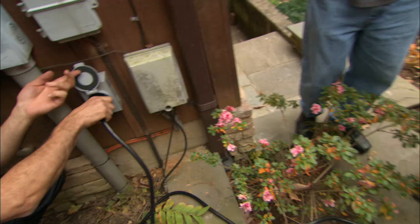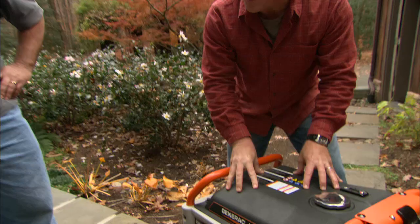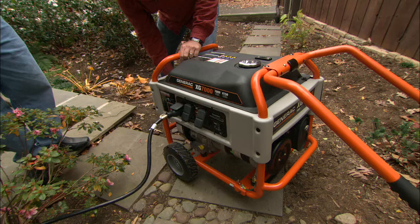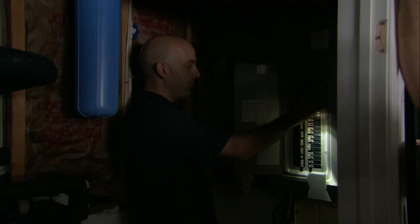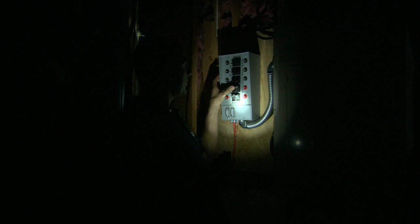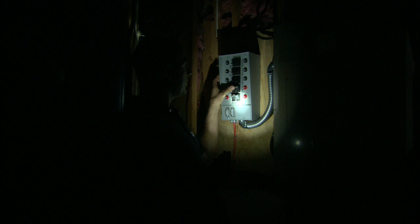This is working off of gasoline, so it is going to exhaust carbon monoxide. The generator stays outside and away from the house. Now that we have the generator running outside, we can simulate a power outage by shutting off the main. We'll go ahead and turn the switches from line to generator — and you are running on generator power.